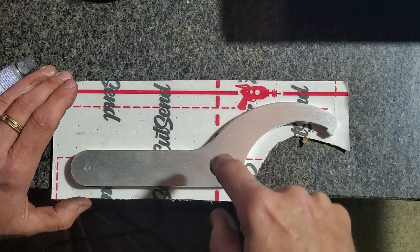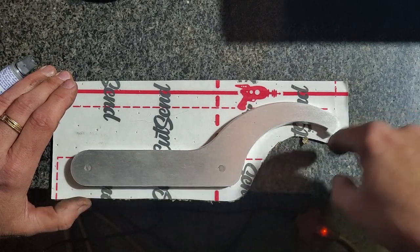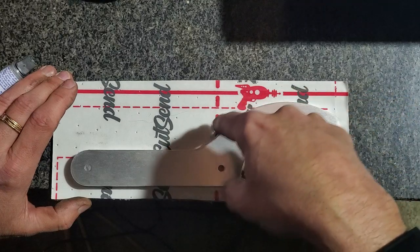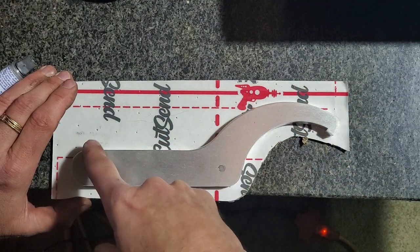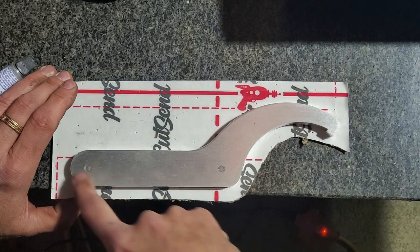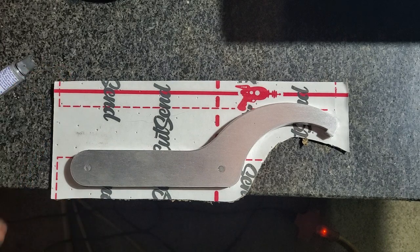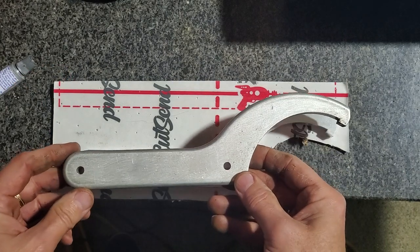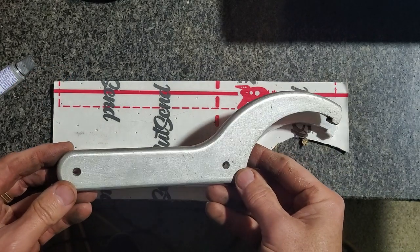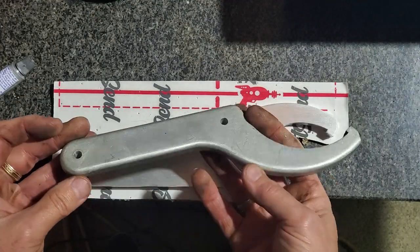And if you fixture this, you just plunge through that with a mill and make a fixture plate. You can know the axes and all the coordinates of all of these roundovers and blends. And then you can put a roundover on this outer edge and have it come out real nice. And who knows, maybe you'll see Keith put the part up and put the roundovers on it like I did on this original.